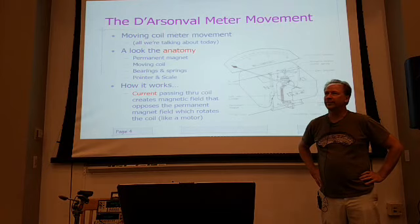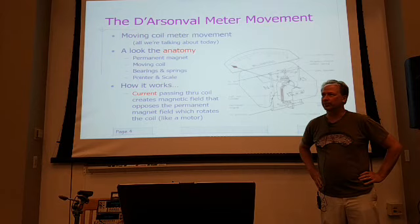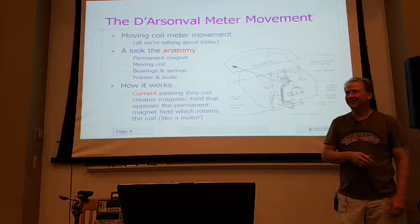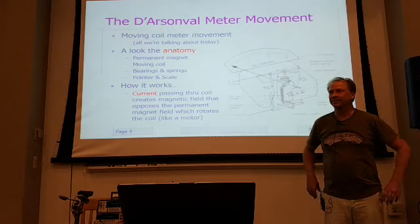So I decided to take the meter apart. And you would be very surprised to know what they used inside this meter. They used 2 carbon resistors. Two stupid silver tolerance carbon resistors inside the meter housing to set the scale, which drifted. I cut them out and replaced them with new ones, metal films I think, and the meter's accurate again. You've got to think about when it was made, that was probably the cheapest thing they could put in. But literally, they stuffed them in the case of the meter.